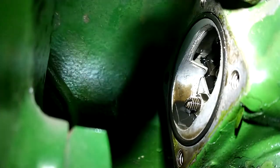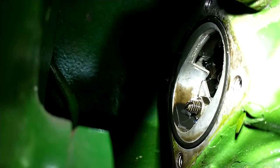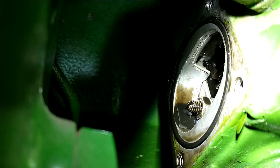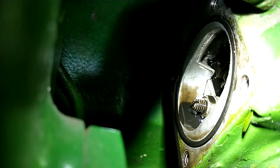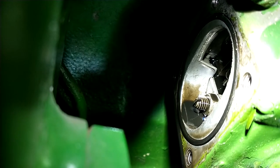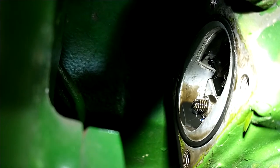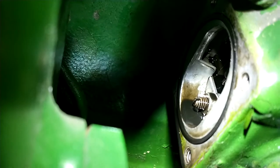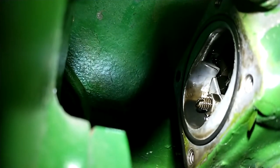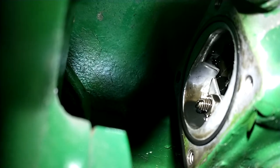Where you see it here, that screw with the flat in the end of it, and that's a 10 millimeter lock nut on the back. This tractor, I've turned it up significantly already. Probably two rounds is all you're going to want to go if you're working it hard. If you want to take it sled pull or something, got it in three right now. I'm going to give it one more and see what it does.